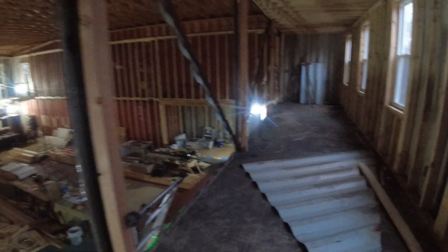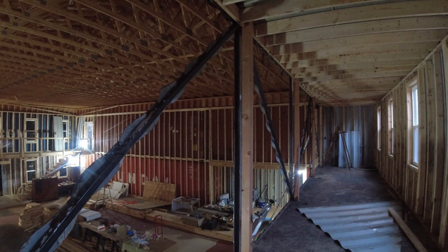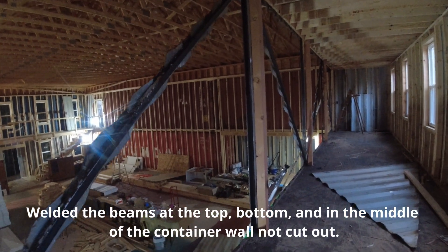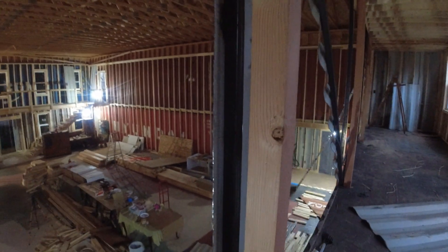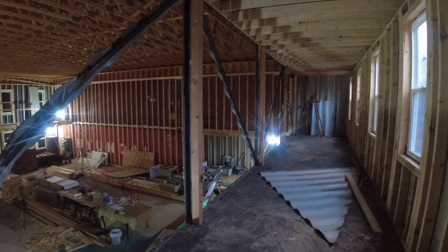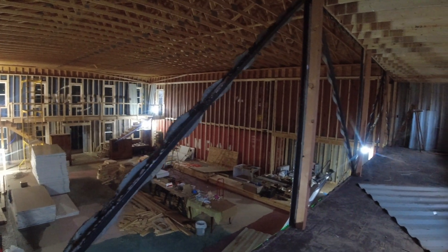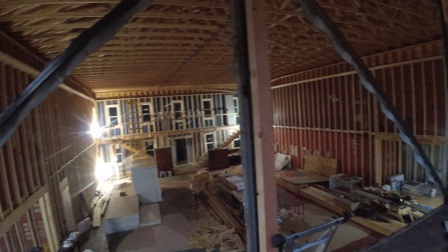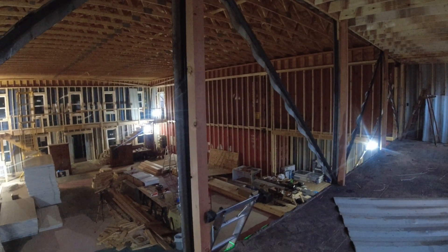The second thing that I've done is to put beams vertically and diagonally to form a bridge truss-like structure. You can see the vertical beam here — that is one and a half inches. I put the vertical beams at 10-foot intervals across the span. Then I have diagonal braces in the 10-foot spaces. So it forms a bridge-like structure to provide structural rigidity, and it has worked.